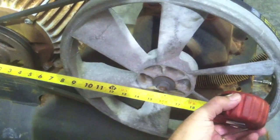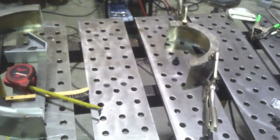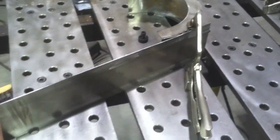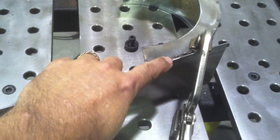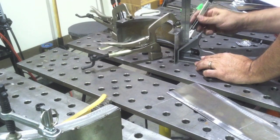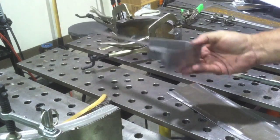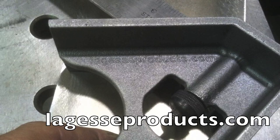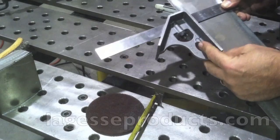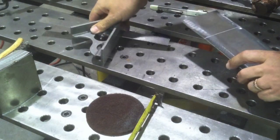Next thing is to remind myself of the distance between the center points of each pulley, which are the center points of each radius I cut. Then I'm going to put everything down on the table with those center points in mind and start laying up the pieces I cut, trimming to make everything fit together. I'll transfer marks with the square — let me talk about this square because a lot of people have asked about it. It's a two-inch wide base combination square, very handy. It's called a LA Square at legessproducts.com — great for transferring marks down round tube.